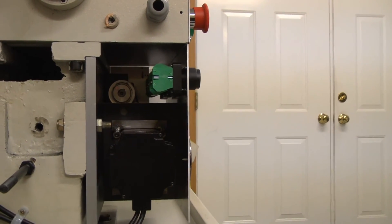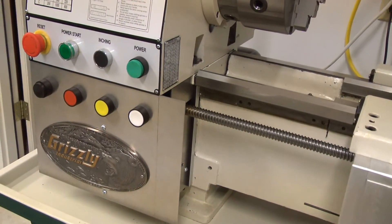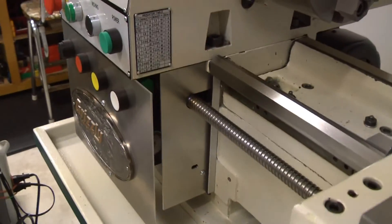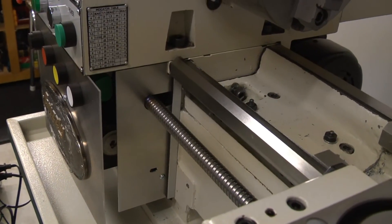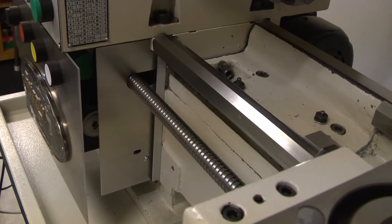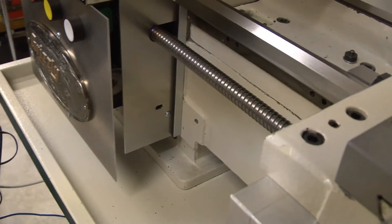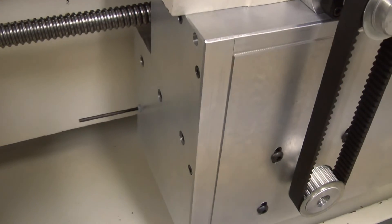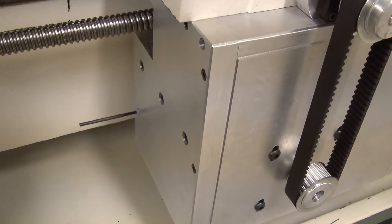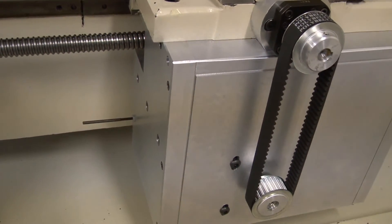It's just a little thinking ahead. Obviously I haven't bent this end panel around yet — you can see the line there — but when it's bent it'll come in and meet the other panel on the back and make a complete enclosure. The stepper motor has a safety switch on the end, and I've got a little rod that hits that switch. I can change the length of the rod if I want to, but that's just a mechanical limit to keep from hitting the end of the ball screws.